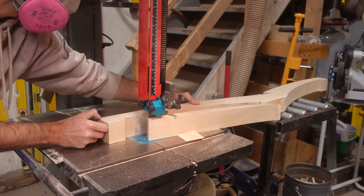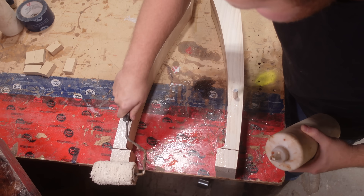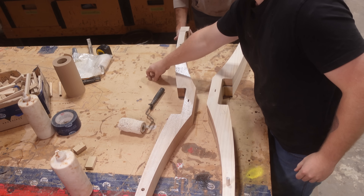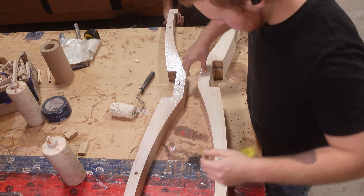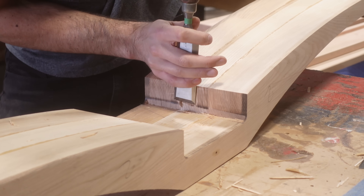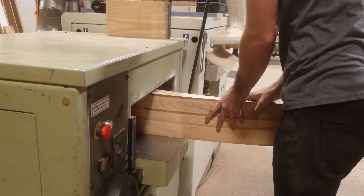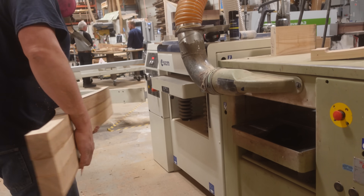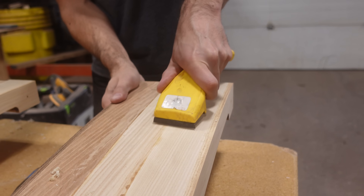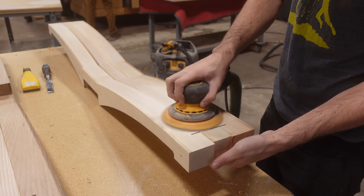Another unique aspect of this project is that both base designs are brand new for us, proposed by the client — a collaboration between our design and his vision. The first base, for the round table, involves laminating plies of ash together to form essentially a T-shaped cross for the top and bottom. Both of these pieces are arched, and we're also going to do a bent lamination that joins these two crosses between the top and bottom. Curtis is sending those laminations through our SCM planer after glue-up, and also using a glue scraper on surfaces we couldn't run through the planer. From there we sand all the pieces up to about 180 grit before applying the blackened finish, and here you can see the cross — both halves designed with half lap joinery so the top surface is nice and flush.